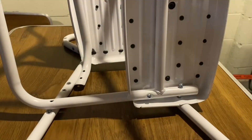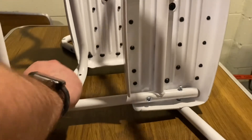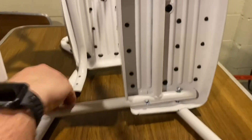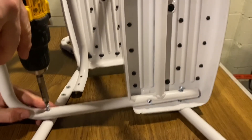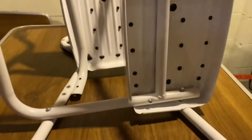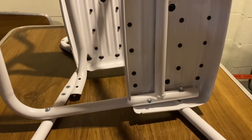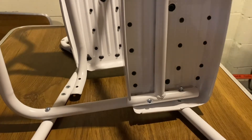Put that into the hole with a little turn, get the medium-sized screw, and put that on the other side. We're going to need four of the smaller screws for the remaining holes — just make sure you're using lock washers to prevent those screws from loosening over time.